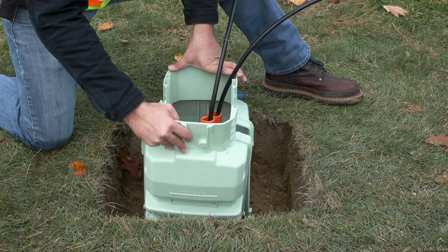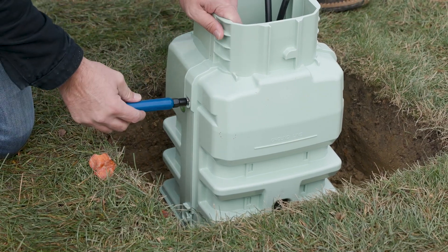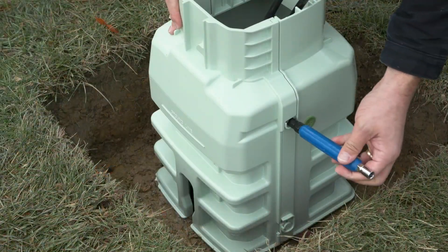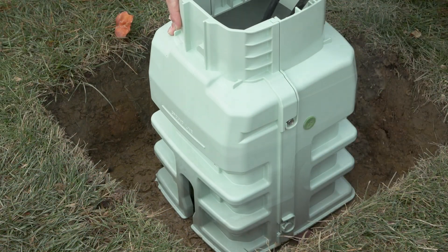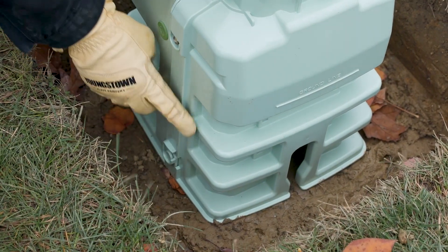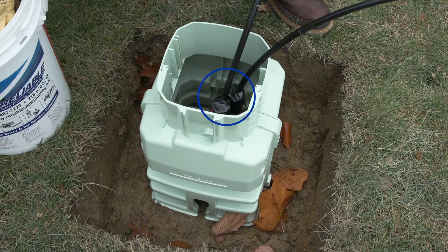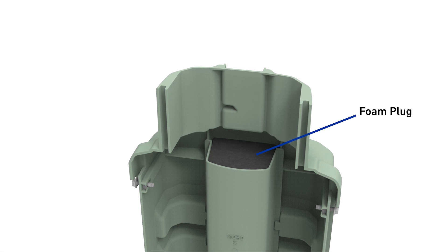Reinstall the front half of the base by aligning the bottom posts and bolts with the rear half. Tighten the bolts on both sides to secure the halves together. Level the base assembly before proceeding. Ribbed walls on the base provide extra stability to resist ground heave. Cover or plug any conduits in the trench to prevent backfill from filling them; conduits can be covered using vinyl tape. Pull the foam plug located inside the drop channel to the top of the channel to prevent backfill from filling the channel.